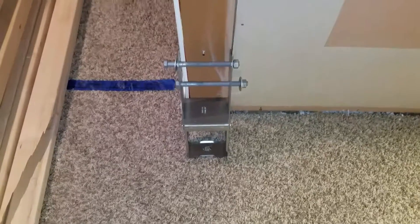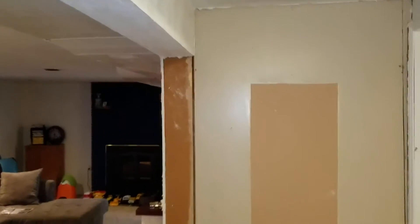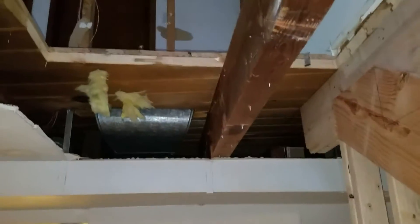So we'll have to do some temporary support framing under this end of the beam. That end of the beam is already supported by the existing wall. Then we have some changes in the plan — the layout of the 4 beams is different than what was thought to be.